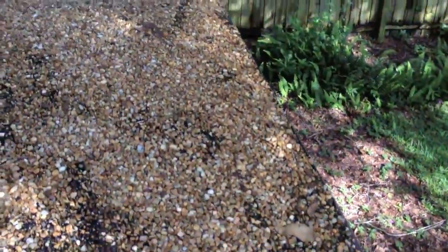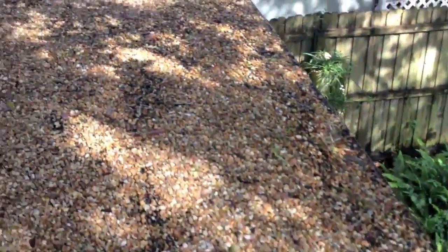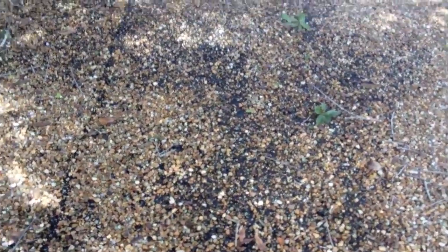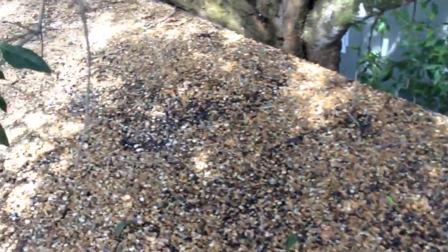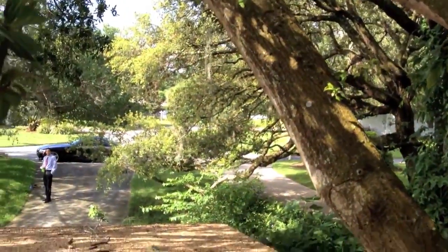Walking towards the left side, you can see repairs that are redundant. On the left rear portion, a recent repair is visible — you can see the membrane sheets and the aggregate size differential. There's quite a large area underneath a tree with a lot of overhanging branches that could have fallen onto the roof and caused damage.